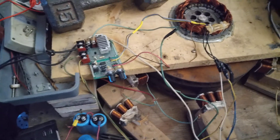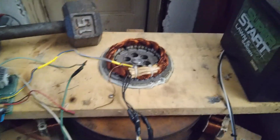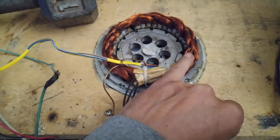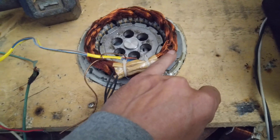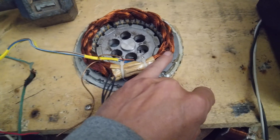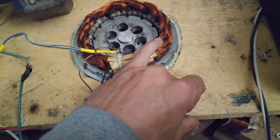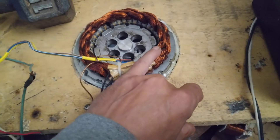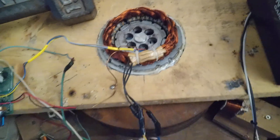Let's talk a little bit about the motor on the bottom, which is a wiring nightmare. It's a wind turbine rewired — I'm only driving off of one of the bifilar L1s. All three phases are bifilar on the bottom. I have them all separated, wound in series, and then I'm just driving off of one single winding on the closest one. Consumption rates are better when I run two in series, but I'm gonna rewire this.